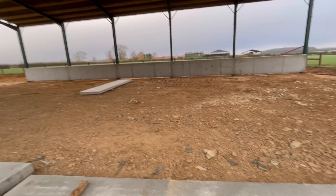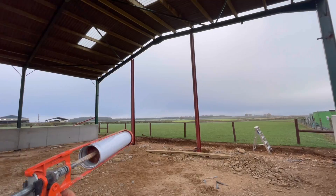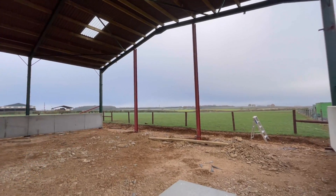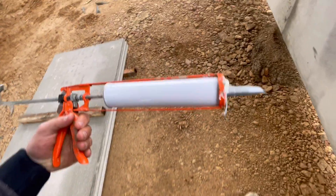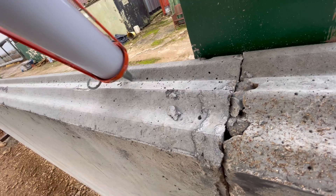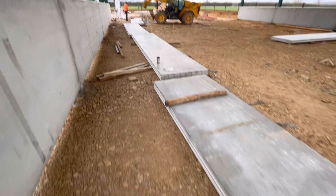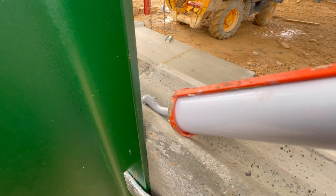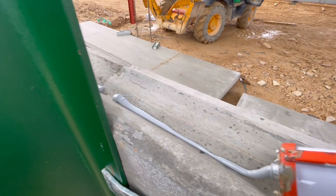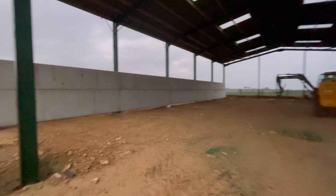First row of 1500 panels is in. Put those end stanchions in — I've got to paint them. I've got this grey silicon which goes in this groove here like this, and you put that along all the way down that end like that, and then that'll seal it and stop the water coming through. Running this along, then the tongue and groove bit — the next one crushes it all in, spreads it all out, stops the water going in. So that's the panels in.